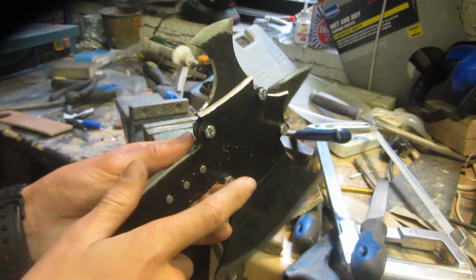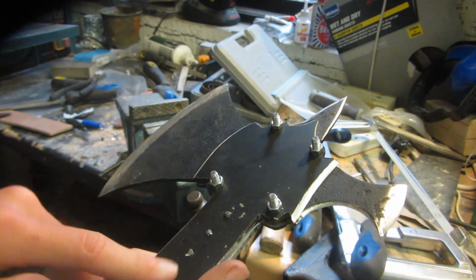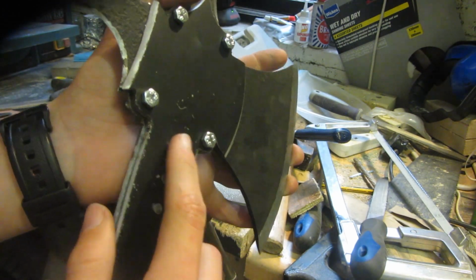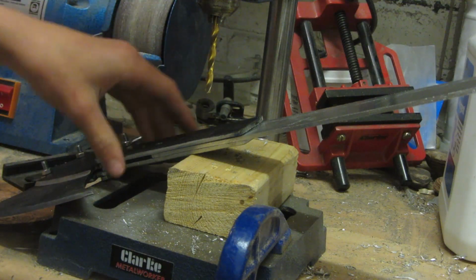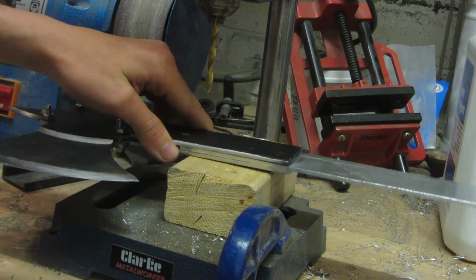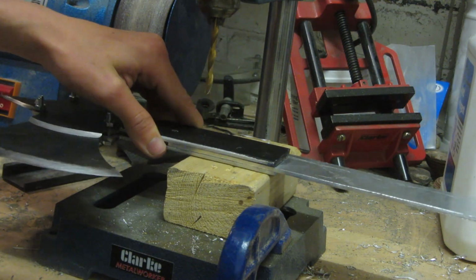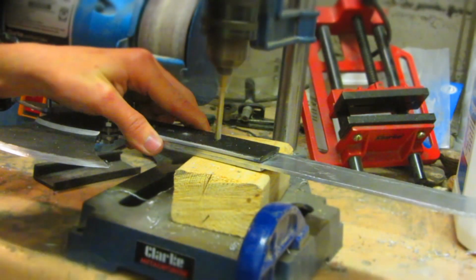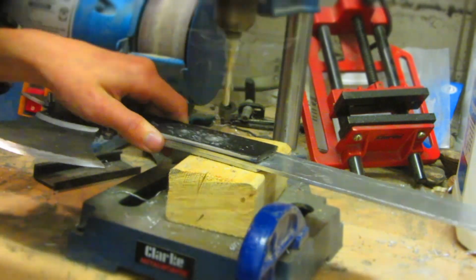So once it's done on this side, this is what it looks like, and I've hammered it all the way down, and the backs of the nails on this side are holding it back here. So now I'm going to use this drill bit here to drill through all three layers of aluminium twice in two different places so that then I can put in two screws. Here I'm just using a regular drill press just for ease of use, but a normal hand drill could also be used.